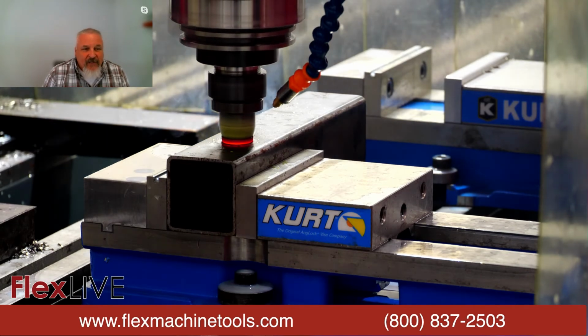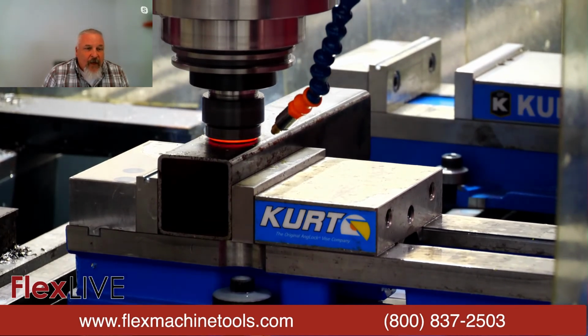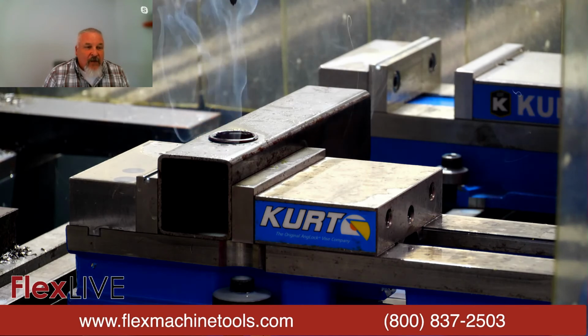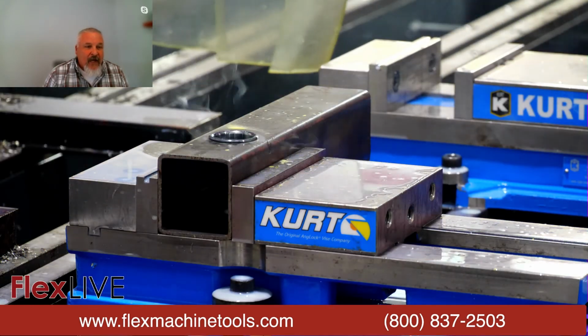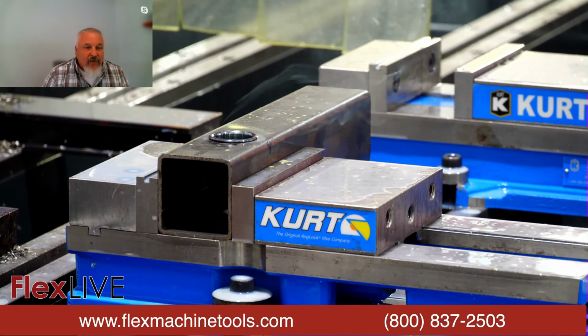As you can see there, it's the same process as before. We're going to come down, form that collar. Basically, on the collar formations, we want that upflow material to hit the corner radius of the Flowdrill bit. We want it to curl back, come down, and just kiss the top of the material that we're working with. So you get a nice, clean, smooth collar.